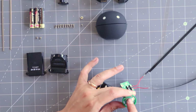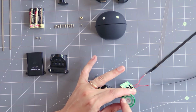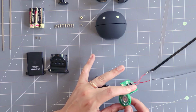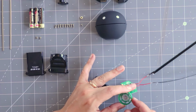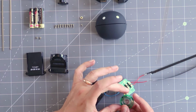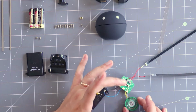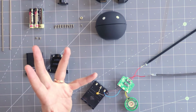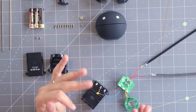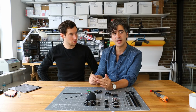We've got this really lovely speaker in here. It's got a really cheap plastic cone, and then what's going on right there? That's the coil. And so we've seen a few teardowns like this so far, but we run a current through the coil, and then there's a cheapo magnet behind here, and then that vibrates. And this whole system, this analog circuit and this cheapo coil and speaker are all tuned to work with each other. There's no conditioning elements in between.